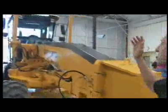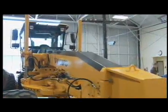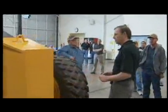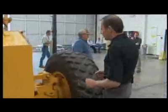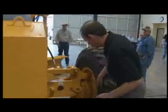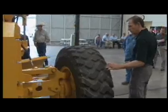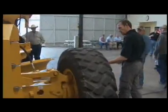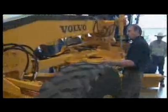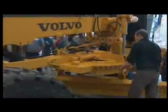Again, glass condition and lighting, mirrors, hoses, blade area, everything looks good here. Debris is gone from the push block. No debris here on the front of the axle. No collapsed components. Hose condition looks good. Tires, sidewalls, good condition. Radial area of the tire, great, no chunks out of it. Mounting hardware, tire pressures.